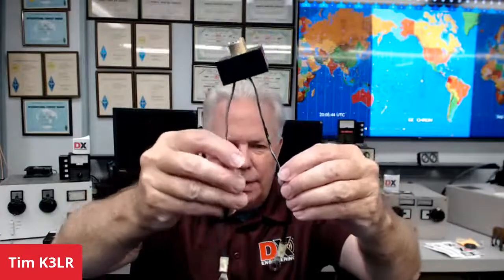So this FPC is a potted system — you get two wires coming out of it. One goes to the shield and one goes to the center conductor; it's very obvious, and they're all soldered inside. This is a great way to feed antennas — very strong. It's a silver plated UHF female connector. We also have them in 7/16 DIN and N connectors as well. This is the DX Engineering FPC — DXE FPC.